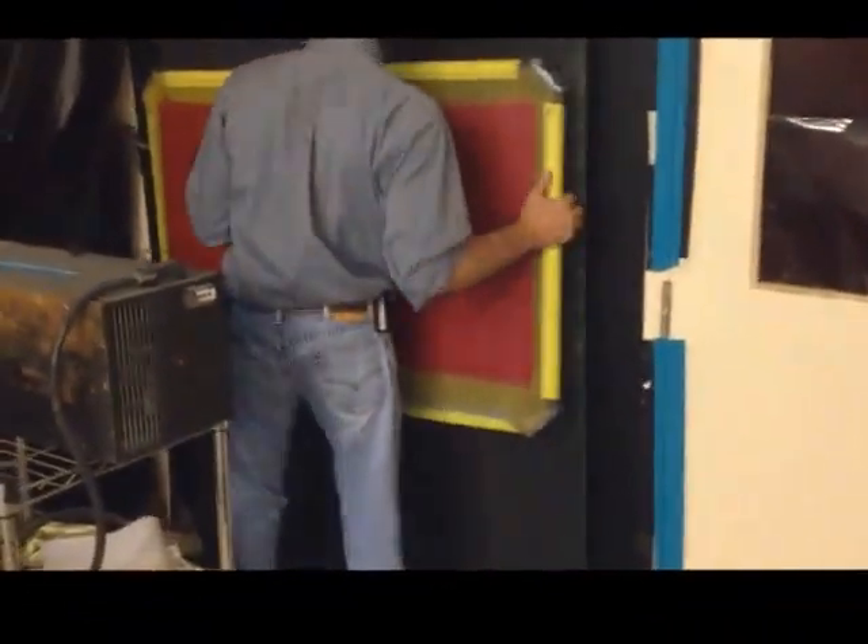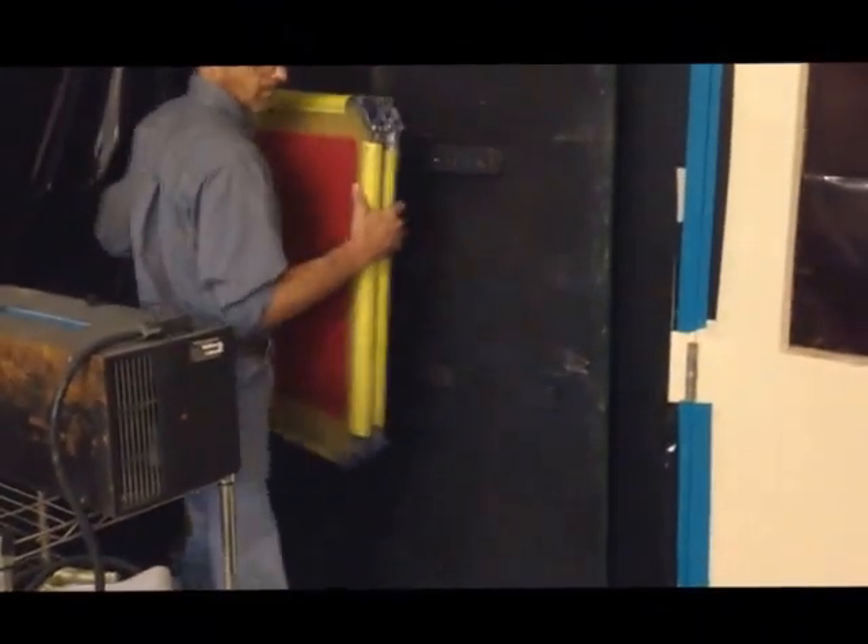The misters go on again as we continue this cycle. Our rate when we're doing this is between 50 and 70 screens per hour, depending on how often you get interrupted. That's why all day long we've been imaging screens on the iJet, because the iJet will only do screens at 25 to 30 per hour — and we're twice as fast at exposure and washout.